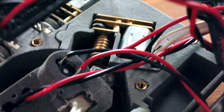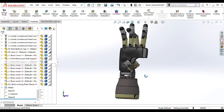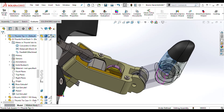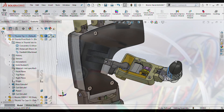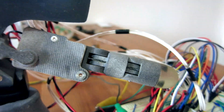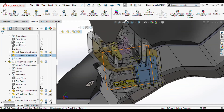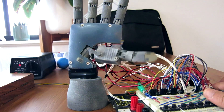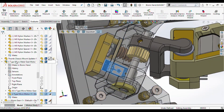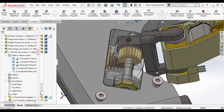I have also fitted the thumb with three motors providing three degrees of freedom. The first motor in the thumb drives a pulley with a tendon connected to it to actuate the phalanges, much the same way as the previous fingers. A u-type micro motor also allows for a pivoting motion at the base of the thumb providing the second degree of freedom, and finally the third motor is again a u-type which drives a worm gear to rotate the whole thumb sub-assembly relative to the palm.